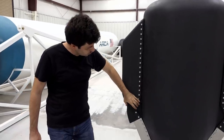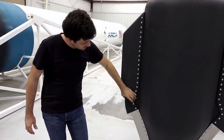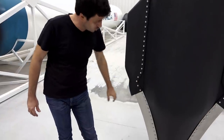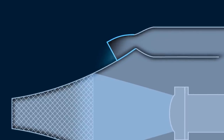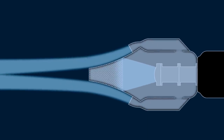The chambers continue with the convergent-divergent nozzle, and here in the throat area of the nozzle the gases are reaching supersonic speed. They then continue to expand on this physical divergent section of the nozzle, and continue to expand throughout the whole length of the Aerospike ramp.